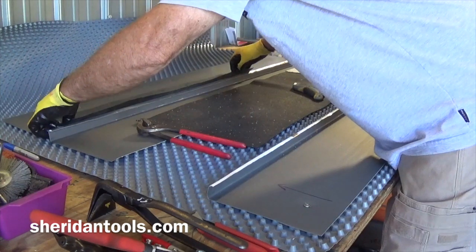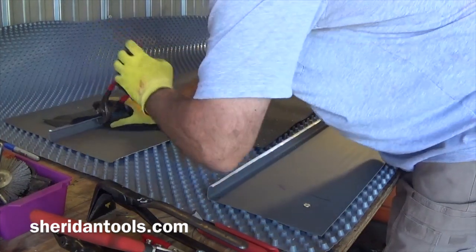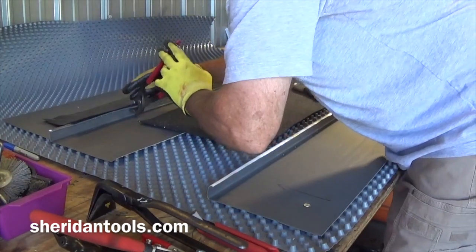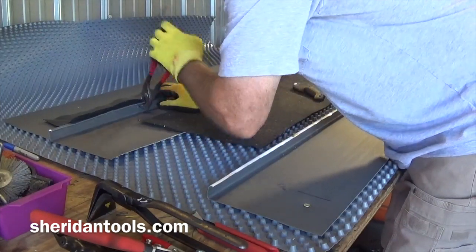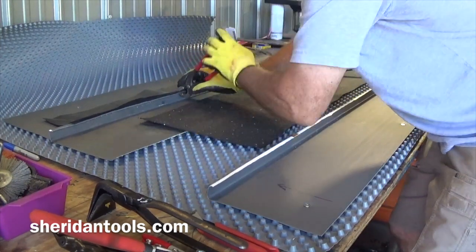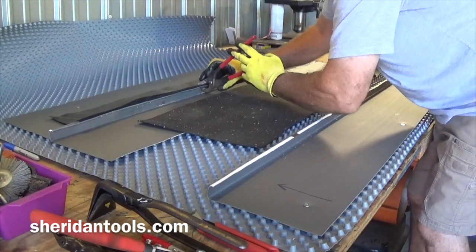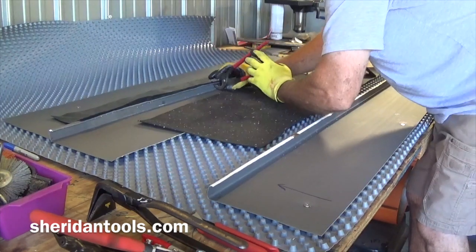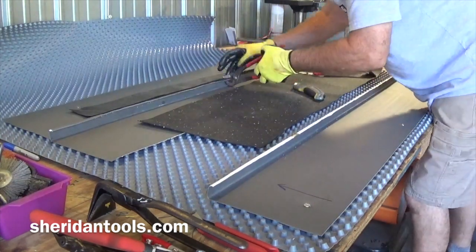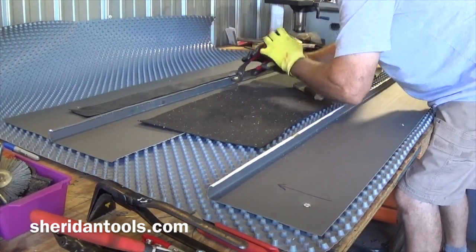Now I've seen some people use tape to do this, but I don't particularly like digging adhesives. You put a piece of tape on here and then you work your way up this seam. Sometimes it's difficult to get the adhesive off of this. So it just creates one more part of the process that you don't really need to be messing with. So I find something that's not sticky, fairly thick. This is EPDM, and it's a little more durable than shelf paper. Not going to leave any black marks, so it's good for this part of the process.